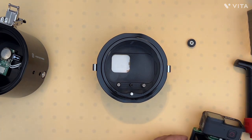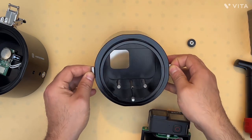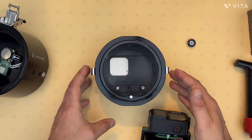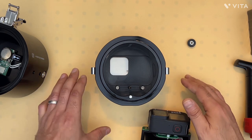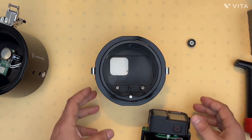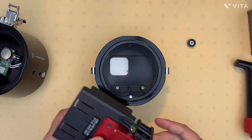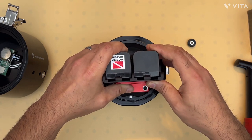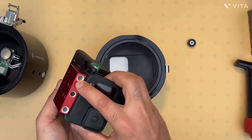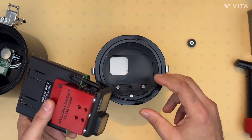The best way to assemble the fixture plate into the housing is to allow the front half to stand flat against the surface. Always work in a clean environment on a surface that won't damage the housing — a rubber mat is ideal to avoid scratching or contaminating the O-rings. Simply slide the fixture plate onto the two pins; the dowel pins allow the fixture plate to stay very securely inside the housing.